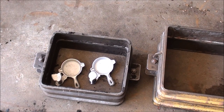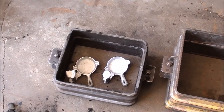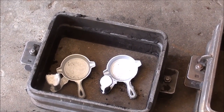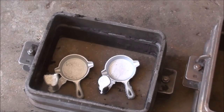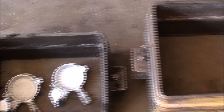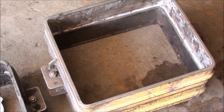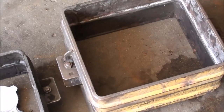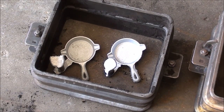On the floor are two foundry flasks. The one with the fry pans is a 10 by 12, and the larger one here is a 12 by 14. I can see now that I can only fit two fry pans in there — I made a third and was getting ready to make a fourth, but two is all I need. The match plate will be made in the larger flask, because the plate needs to be larger than this flask, and the match plate will then be used to make the finished fry pan castings in this 10 by 12 one.